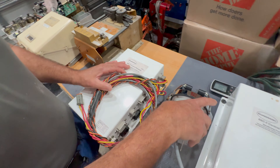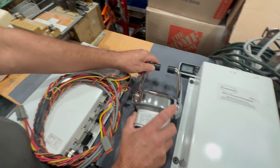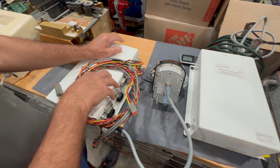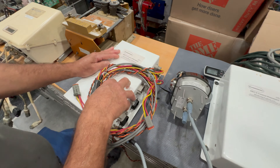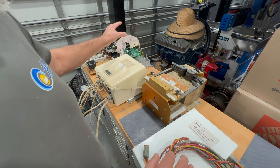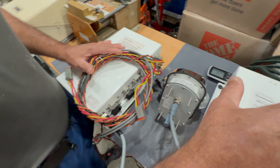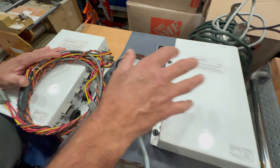The processor has been running for 72 hours at the bench. This is for the L650 C-Ray that we took out. We brought it to the shop to bench test and found out that the processor was defective. Here's the main board that we took out of it — we have issues with that board, that board we do not touch, we normally discard it. But we're not going to go to the boat empty handed — not only with this processor, we're going to go with our backup as well, so that in case we have a situation we have a solution.